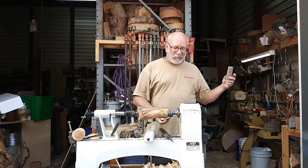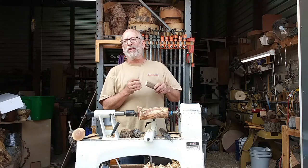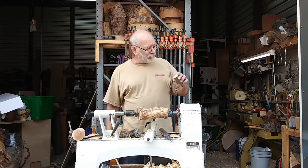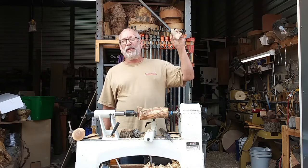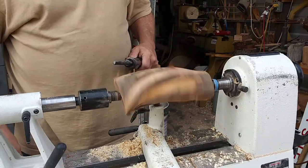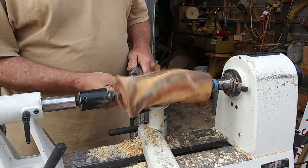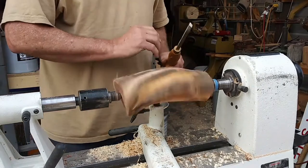The thing that you actually have to select more carefully is the stems. They can't be cracked because they're going to be hollowed out and the walls are going to be fairly thin, and if you don't get a fairly good dry piece of wood, it's going to leak salt and pepper and whatnot. That's the harder and more careful selection you have, is to get the stems that are good, sound pieces of wood. So I'm going to start out by making a cap. So I'm going to make a tenon.